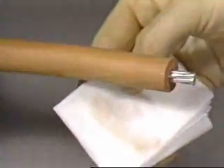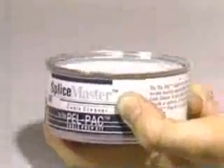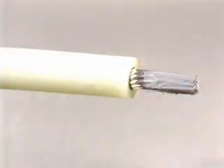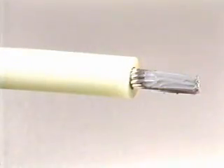Avoid such nicks or cuts in the first place by using proper stripping tools and techniques. Electrical cleaning solvents will remove other contaminants which may be on the insulation. Here, an accidental smear of aluminum contact aid needs to be cleaned. Because the contact aid contains metal particles, it should be removed with a solvent wipe. Sanding could press the metal particles into the insulation, providing focal points for failure. The cleaning technique is similar to those demonstrated previously.